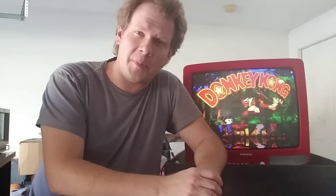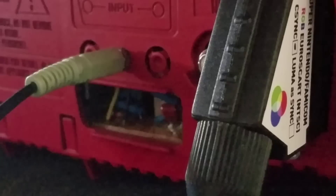A shout out to Phil Exile for helping me troubleshoot this — he suggested it was probably a bad transistor, but it actually turned out to be a resistor that got basically cut in half during some time when I was moving it around. Thanks a bunch, Phil. Now that the TV is working, I also added a stereo audio out mod through a little hole in the back. I unwired the mono audio from the SCART input and upgraded it to stereo out, so any stereo plug or adapter will now work with this TV.